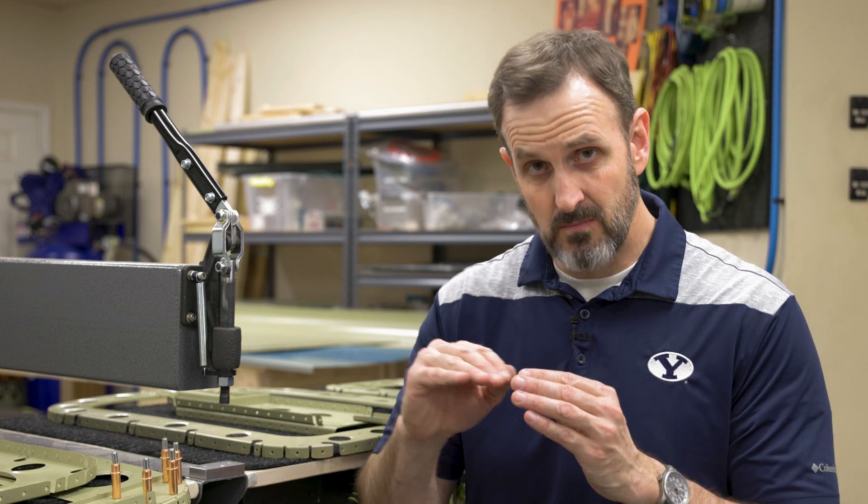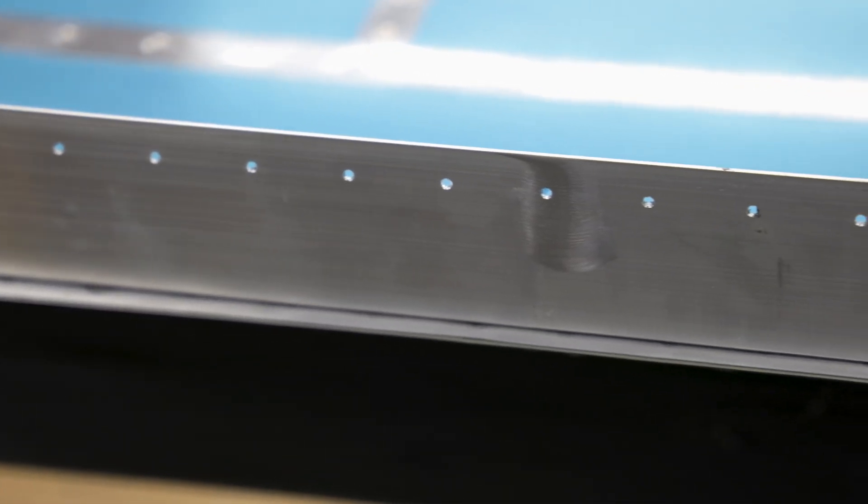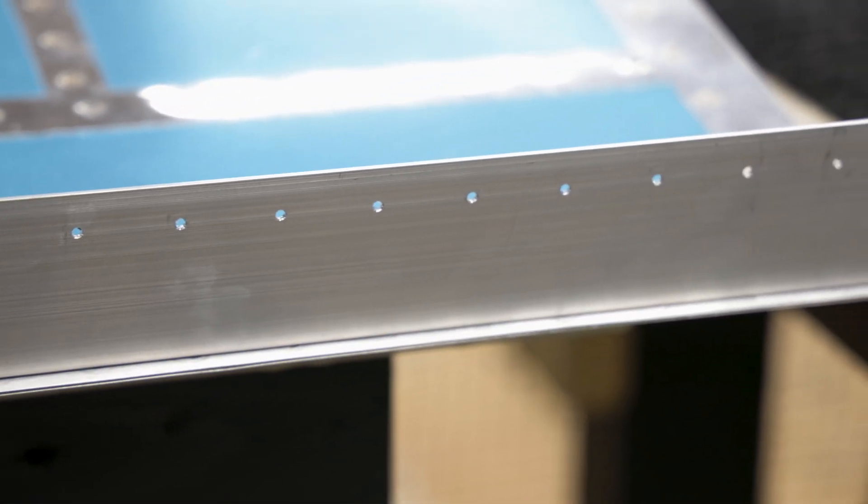That Cleveland tool worked really well on my practice kit, but on the actual trailing edge of the elevator the shop head wasn't perfectly flush with the skin. So after that I went back - I didn't videotape this - with the back rivet set and kind of smushed it down the very last bit. So that's basically what I did in three steps: partially set with the back rivet gun, set the rest of the way with the Cleveland trailing edge dies, then finished it off a little bit with the back rivet gun. After all this, the trailing edge on both elevators was absolutely straight - almost perfect. I put the angle iron on the trailing edge and it was pretty much perfectly straight, maybe off by 1/64th of an inch on one end of one of them. I was really happy with it. There is some lumpiness especially on the bottom, and I think that's because I put too much tank sealant on.